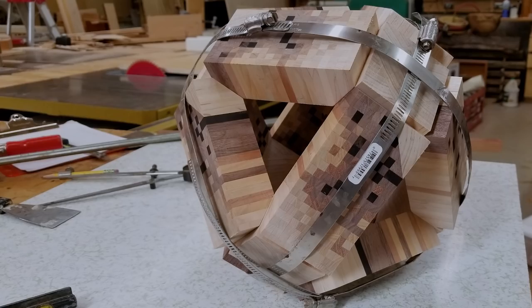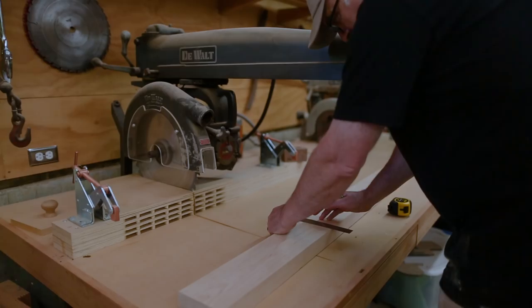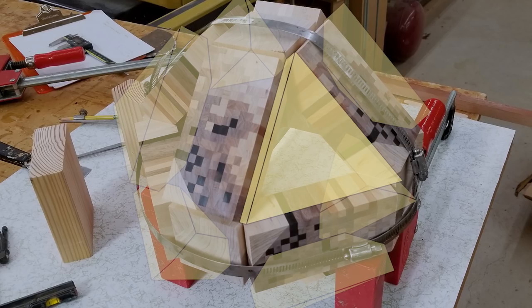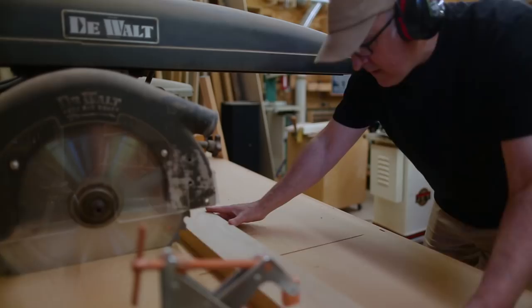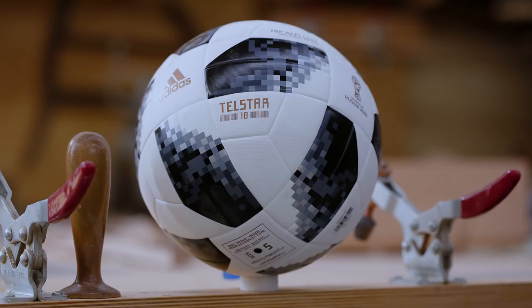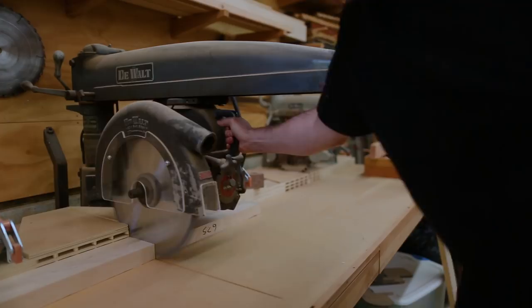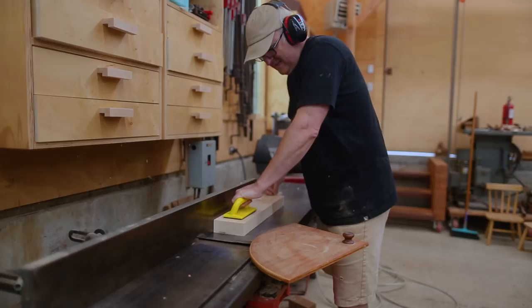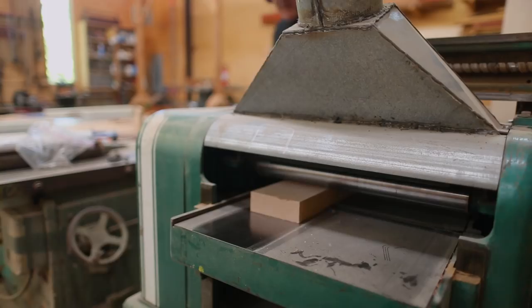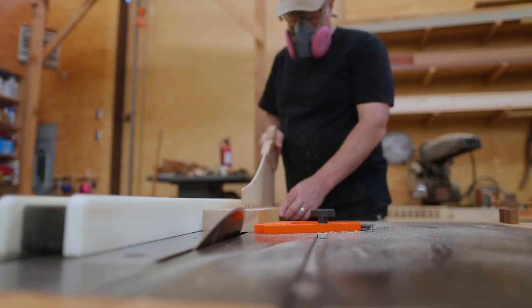At this point I could begin to see what the triangular infill pieces were going to need to be. There's a definite pattern in the way that the ball is put together, and I wanted to follow that with the way the segments would be put together. I joined and planed some pieces of wood at the right length and cut an angle out of those — I believe this was 30 degrees. This was pretty straightforward.